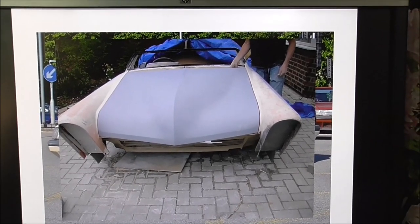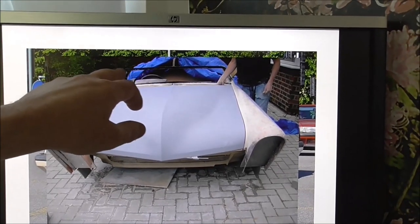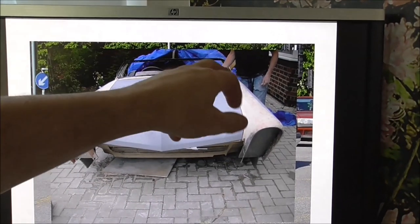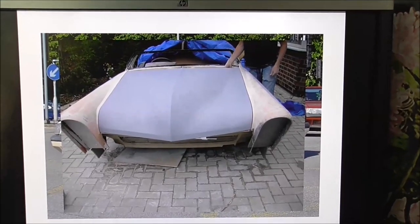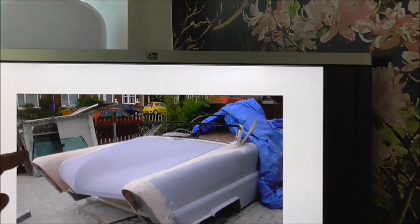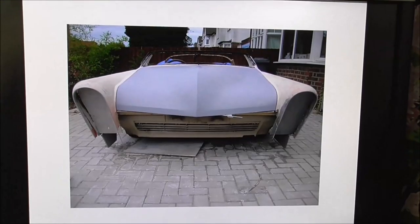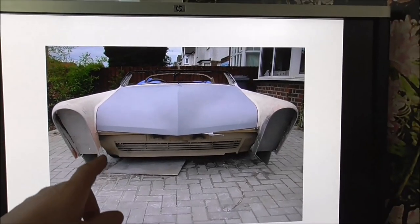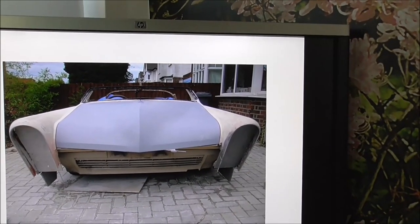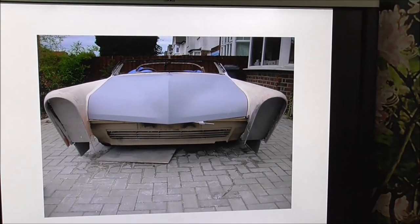By this point I'd braced the chassis and cut the roof off. I started making the windscreen aperture out of angle iron, then just pie-cut it and welded it back to what was left of the Citroen window pillars. There's another shot of it and the familiar shape is forming. In the background you can see the roof of the Citroen, broken windscreen and all the other bits. Lots of this Citroen was made of plastic, which was quite weird. You can also see that the Citroen front bumper was kept on — a lot of this car was built around a timber frame and I could fix to this plastic front bumper really, really easily.